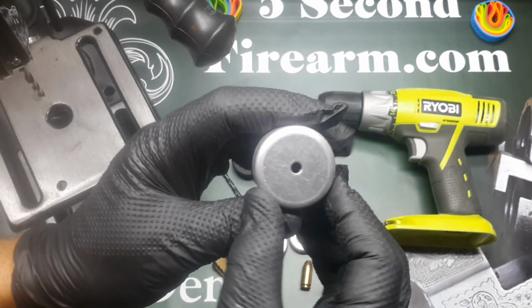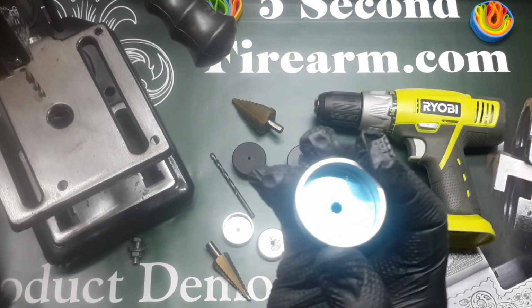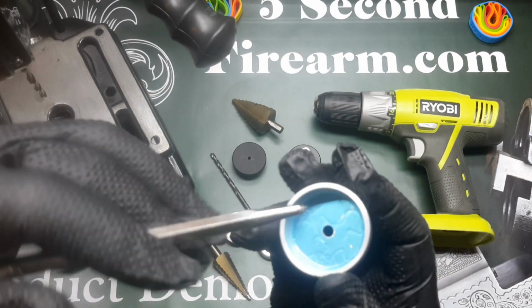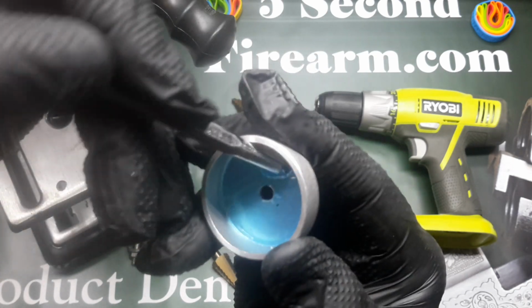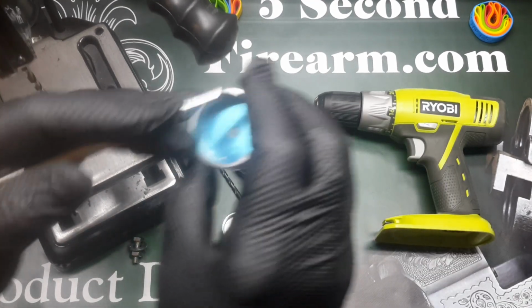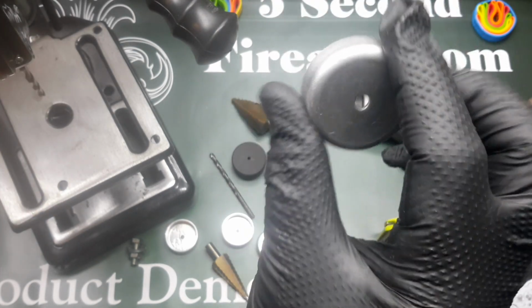They're done on a 30-ton press with a template, so that ensures you've got a center hole without variance under pressure. Some folks like to heat this stuff up into liquid jello and pour it into a mold. Some manufacturers do that with this 1060 aluminum, and it has a way of really killing the temper of the aluminum. There's some debate about that. That aluminum is not a tempered metal, but we like to cold punch them. It gives us a little more control over the actual shape of the cup and the hit of the center punch on the template. And then this is a little safety protector to keep from scratching the aluminum. We actually have to pull these out and remove these for our cups. So just to show you that our cups are cold punched, let's do this one as well. Well, if I can get it started. There we go. And then pull that joker right out of there like that. And that's how we start with our cups.